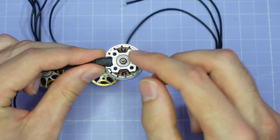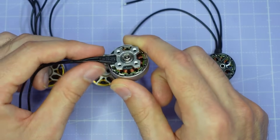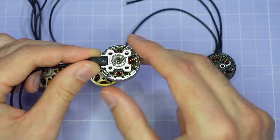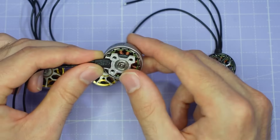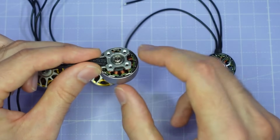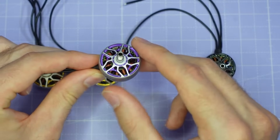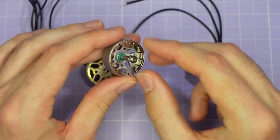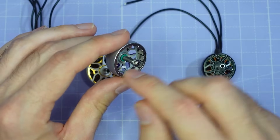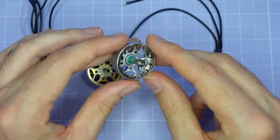If I turn the motor over and come to the base, we can see a quite simple base design with a feature to hold the power cable. The bearings are 9mm by 4mm NMB bearings and the shaft screw is an M3 shaft screw, which is nice to see. That's pretty standard now on motors of this size and it just makes it that little bit easier to take the motor apart if you ever need to replace the bell. The windings are single strand windings — let's take the bell off so we can see these a little bit better. Once I've removed the rotor, we can look at the internal construction. The M3 shaft screw is held in with Loctite, and you can see there is a little o-ring inside and a washer to cushion the top bearing in a crash and help that top bearing run a little smoother.